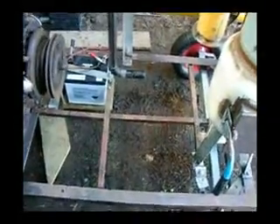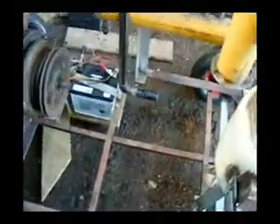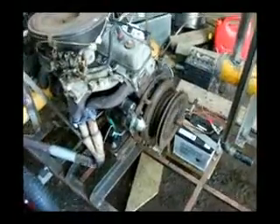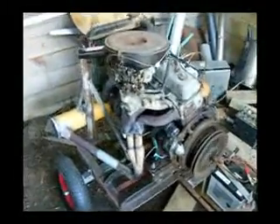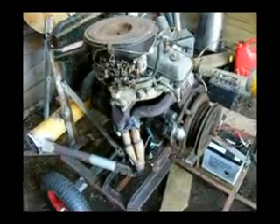The gas, having been taken from here, is drawn up through this pipe, round the corner, and into a filter that will occupy this area. The filter will have wood shavings and whatever else I can find — maybe even hay. I've also developed a set of blast gates for the filter, but it's nowhere near finished yet. From the filter, the gas goes down to the engine through a bubbler — I'm thinking of bubbling the gas through motor oil, which should help get rid of any residual grit and prevent backfiring, as I'm not happy about a dirty-grade explosion ruining my day.